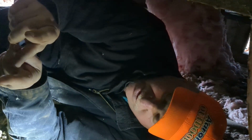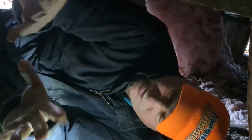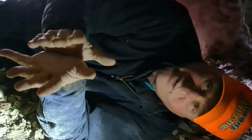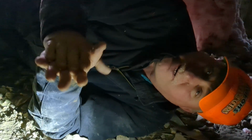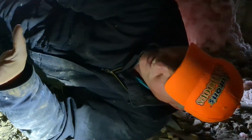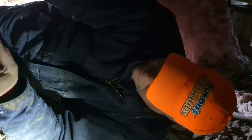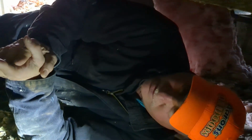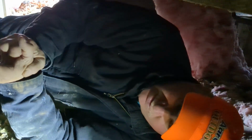So you have to have that return air, which sometimes there's a vent at the bottom of the doors of mobile homes, and a lot of times though they're just up off the floor, and you're like, why do they make the doors so high off the floor? It doesn't make any sense. Well, it's because that's your return air. So anyway, I thought I would let you guys know this is a good viewpoint of how a mobile home works and the reasons that they did such a thing.